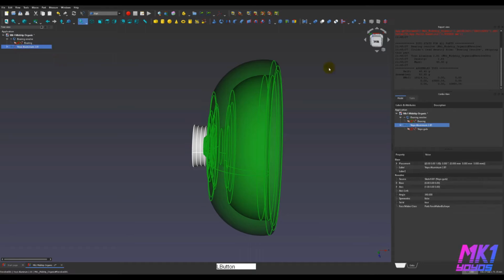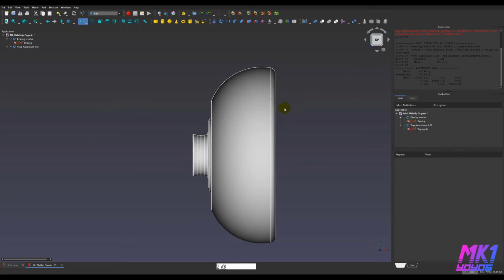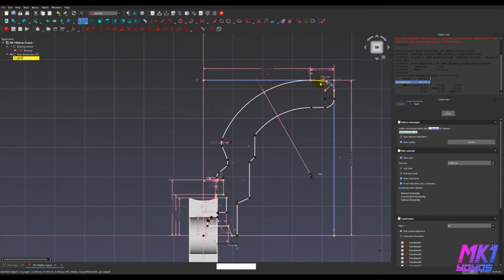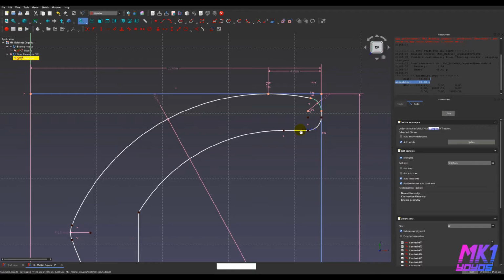So this is a very chunky shape. We can see how thick it is. So this calculation says that the yo-yo would be 93.6 grams. That's obviously way too much, especially because we're going to add a steel ring here, and we want the aluminum part to be pretty light before we add the steel. That'll give us some room to do some stuff. So let's make this thinner.